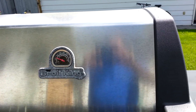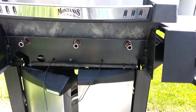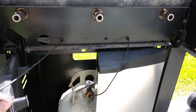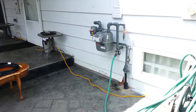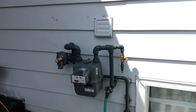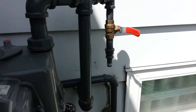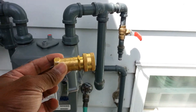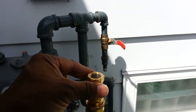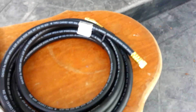I'm converting my barbecue from propane over to natural gas. Basically, we're going to get rid of this propane tank, go right to the house, and take it right off the gas line there. We've got proper coverage, and we're going to put a valve on there — a quick release — and hook up a nice 15-foot hose, which gives me a little more room to work.